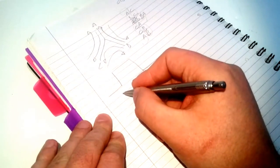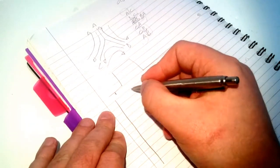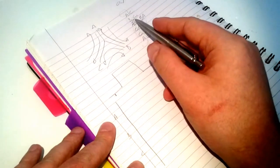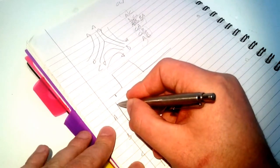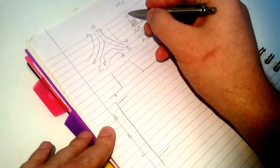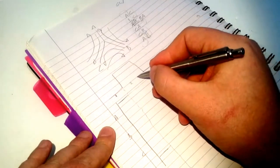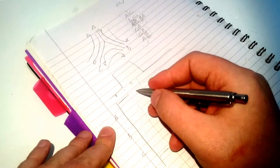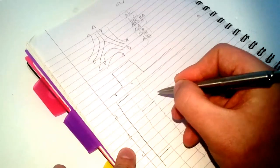Let's go through those steps. In Step 1 we want AC: so we have phases A, B, C — on Step 1 we want A high and C low, meaning A needs voltage in and C needs to have voltage off. Then Step 2: we would have B high and C still low.